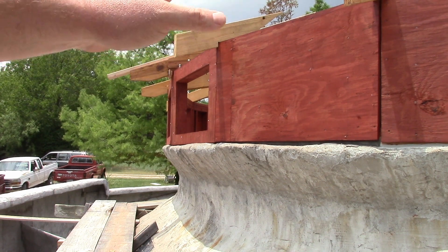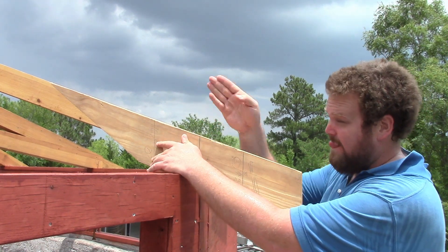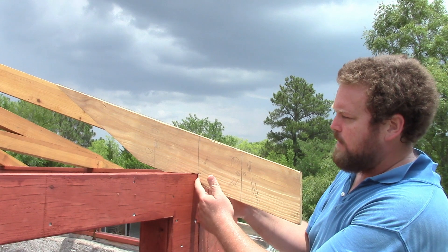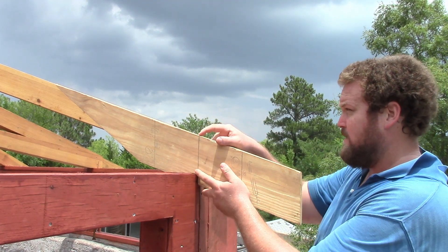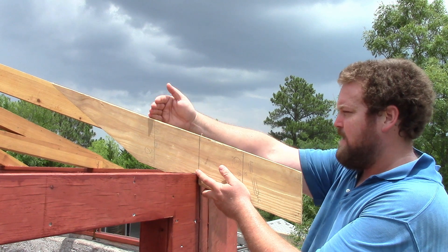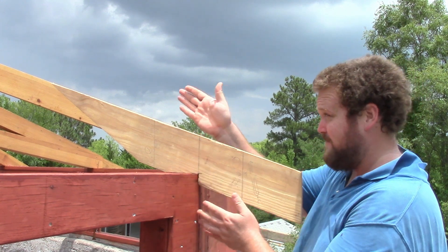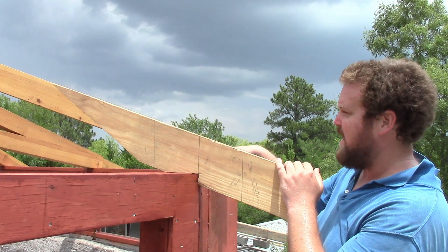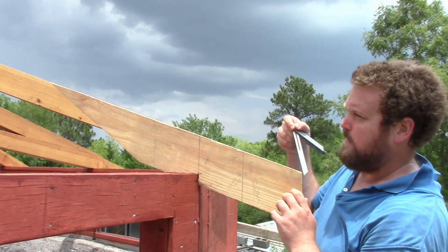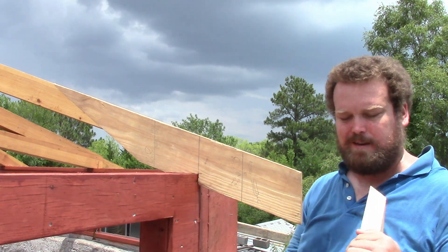That caused us to have unique angles for our rafters. So each rafter is fairly unique and we're using sort of an analog technique of figuring out the angles. We built this little short piece with our bird's mouth and the height above the deck that we're looking for. Then we run a string from the top of this to the top up there, and we can get the length to plumb. We're also taking a measurement to the corner of the bird's mouth, just to make sure we get it right. And then with the string on top, nice and tight, we'll figure out the angles of the top cut and the bottom cut. We mark our angles, write our lengths, and get both sides.